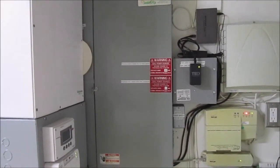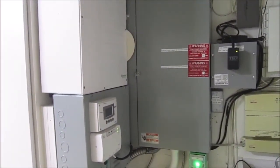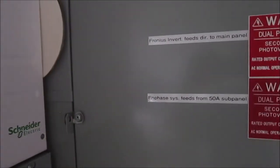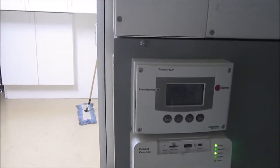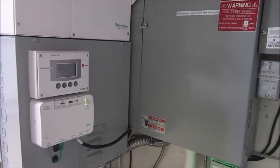Now we're inside the garage, just opposite the meter panel where the maintenance bypass is installed. If you notice, there's a 100 amp and a 60 amp breaker in there. The 100 amp breaker is the bypass — it goes directly from the meter and nipples through the wall and feeds into the top of the panel, if I ever want to do that. Right now it's off. The main power goes through the 60 amp breaker, through the box, into the junction panel under the Schneider inverter, into the inverter on L1 and L2 for the AC side, and then back out. It back-feeds the bus bars through a 60 amp breaker in here. That way I backed up the whole house without having to add a subpanel just for critical loads.